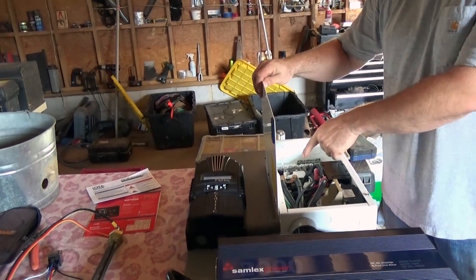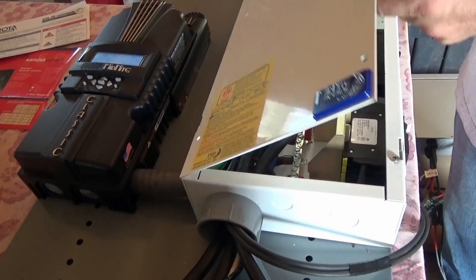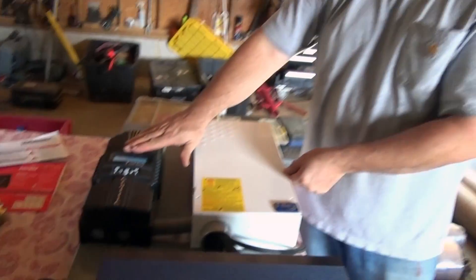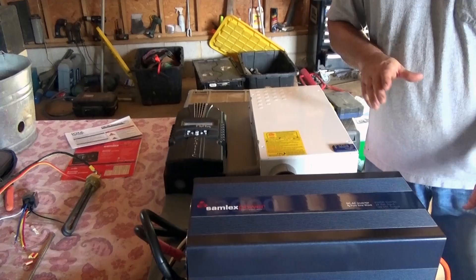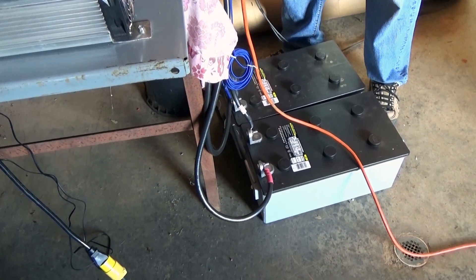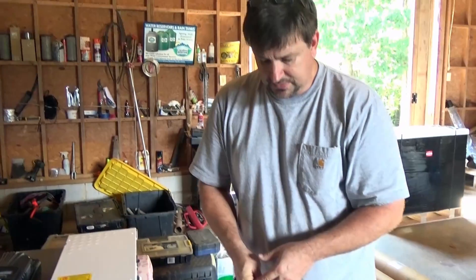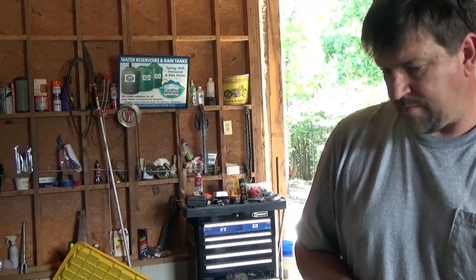We also have what's called the Whiz Bang Junior — a shunt system that lets you monitor power in and power out. It's programmed to the exact type of batteries in use. Right now I have two 8D 12 volt batteries in series for a 24 volt battery bank. We do lead acid, sealed AGM, and all different types. Some people prefer AGM because they don't want to deal with lead acid, but we prefer lead acid for performance reasons.